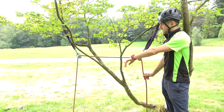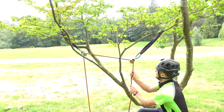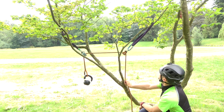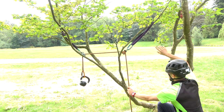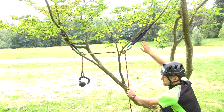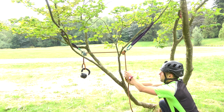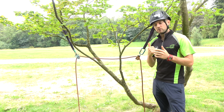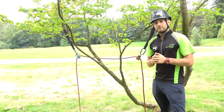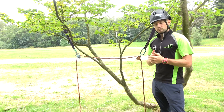Now what I'm going to do is raise that weight using two rigging points. Now I'll just hold that weight there and you can see this stem — especially the one that was flexing the most, that was coming down to about here before — now that stem has hardly moved from its original position. And it's really easy to show why. The first thing I want to touch on is rope forces and rope deviation forces.